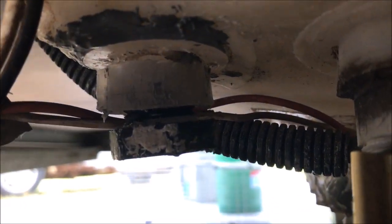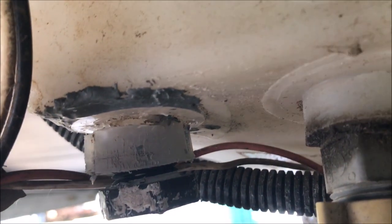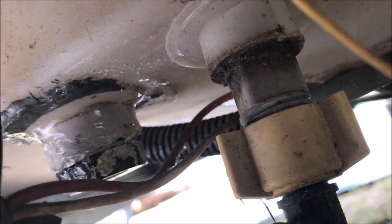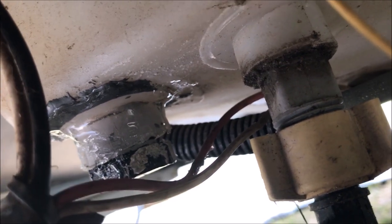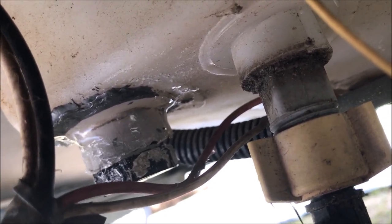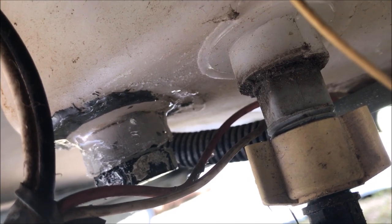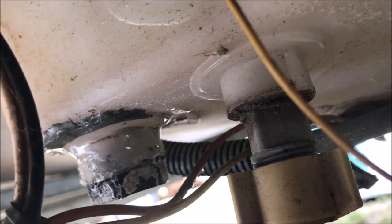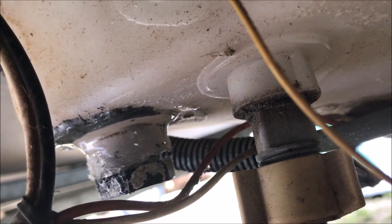I'll glue it up now and leave it sit for about 24 hours. I brushed it with the wire brush and then liberally Shoe Gooed it. As I understand it, this is not a pressurized tank — it has a little pump that draws the water out — so all we're trying to do is contain gravity. The Shoe Goo is in place; it's about noon and we'll give it 24 hours to see if it holds water.